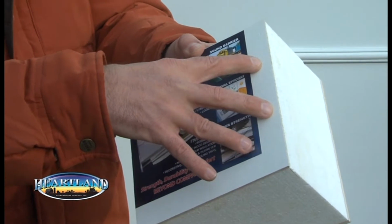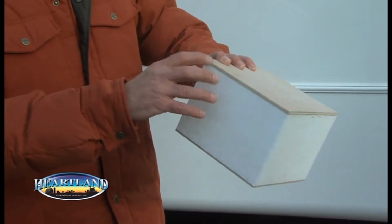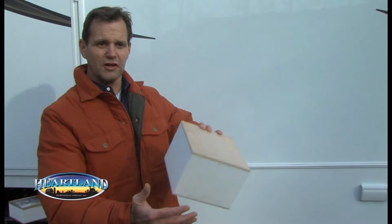And for our roof system, same thing. You've got your interior piece that you see from the inside, your ceiling, and then your foam block insulation, your exterior portion of the roof, 5 inches thick of foam block insulation, aluminum rafters, and it's all glued together with a vacuum bonded system. So it's real firm and real solid. It makes the roof completely walkable. And then on top of it, we cover it with a 12-year EPDM rubber roof system to protect the outside of it.